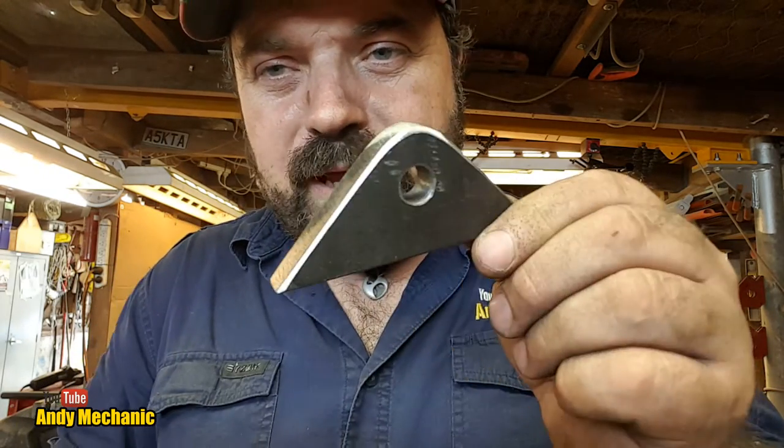Very, very useful. It's amazing how often you need to attach things to steelwork temporarily, maybe an engine hoist or a little crane, or whatever. Or you want to use a ratchet strap and pull something across, and you can just hook it straight onto this. I thought it was a great idea, actually. Doesn't take too long to make. And I did make them super strong out of 12 mil plate steel. So one of these, with a big weld surface, will take a hell of a lot of load. It won't fail.